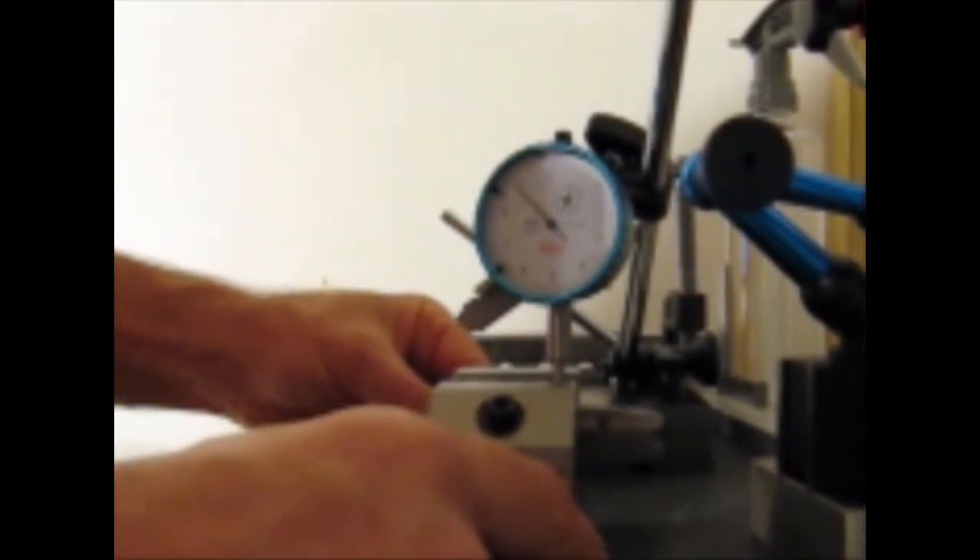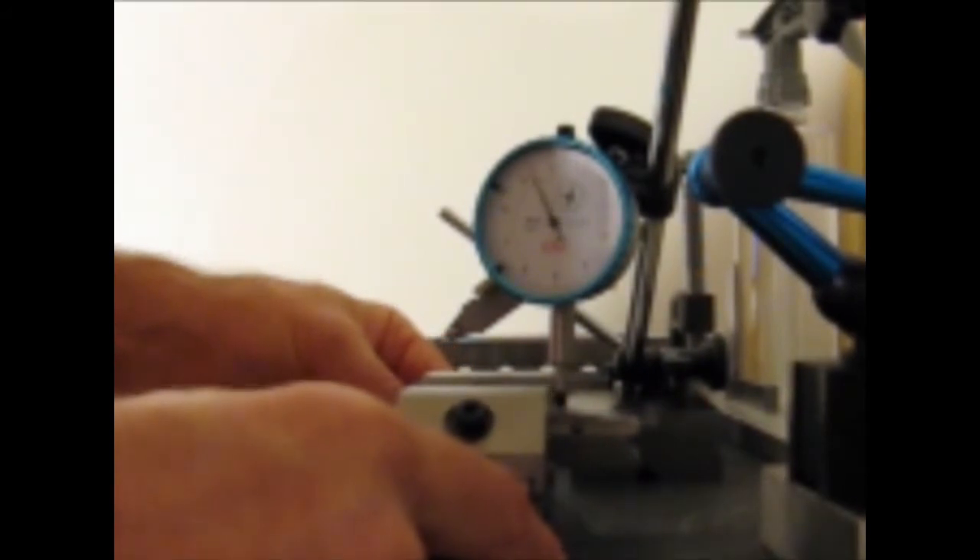Let's exit and enter again. When you don't apply pressure evenly when you're measuring this precisely, it makes a difference. I'm going to sweep the length of the bolt on the other side of the firing pin. I'm at the charging handle groove now — let's back up. That's the exit point, right there at about zero. That shows you the difference in the thickness of the bolt. It's actually not bad — 2 thousandths over the length of the bolt on the measurable flat surface.